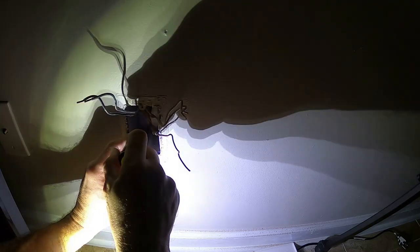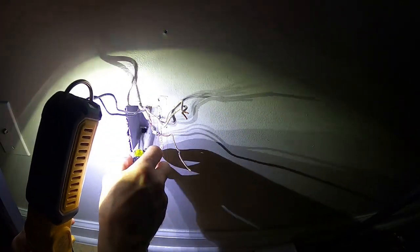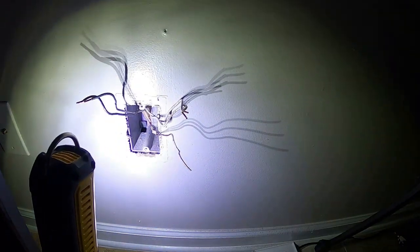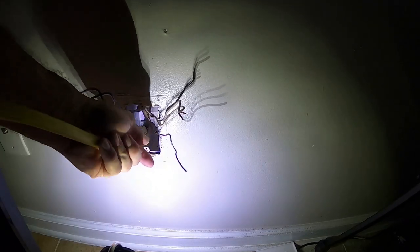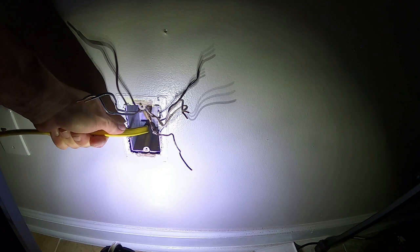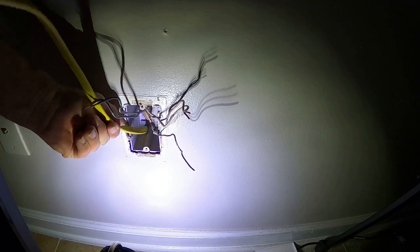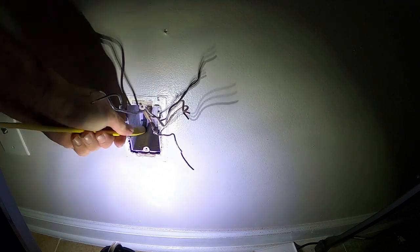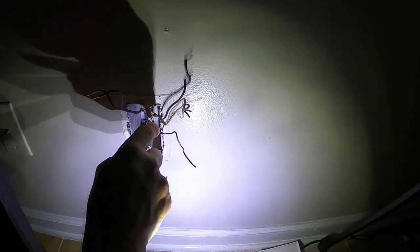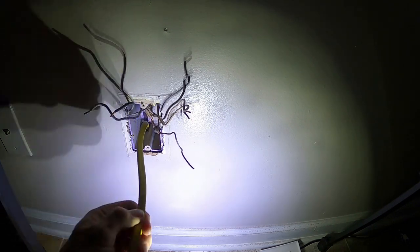I know my box is right here on the other side. I'm going to take this tab in the back of the electrical box, knock it down, and push my wire through that way. These plastic tabs are made to push from the other direction, not this way, so I just pried it out. I'll take my wire, make a little hook out of it so when I put it down in there and turn it, it'll pull out the other side easier. My other side - I've verified I've got enough wire coming out. I'll measure this one to about where the other one is and cut it off.